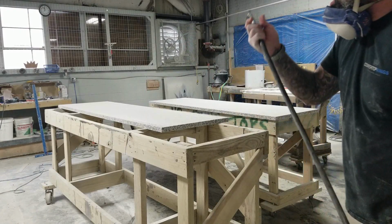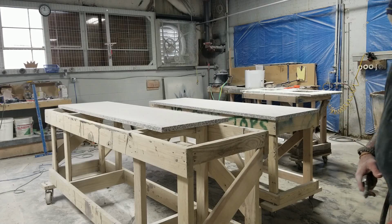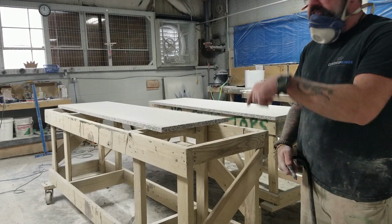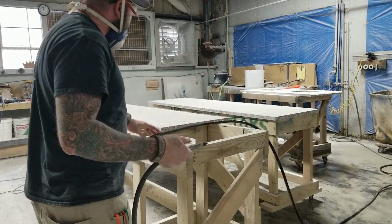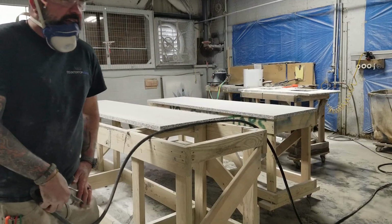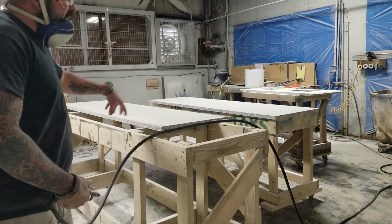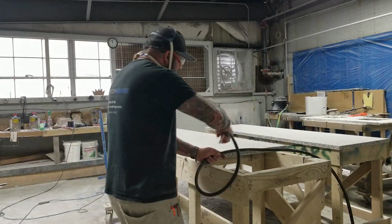Out and cut, we're going to take an air hose and we're going to blow out our cuts. And then we'll turn the fans off so you can hear a little better. And we'll see if our rods fit in it. What we do is we try to get all that dust out of here. That way when we put our flowing in there, which is our epoxy, it'll get in there and stay solid without the dust causing it to fall out.